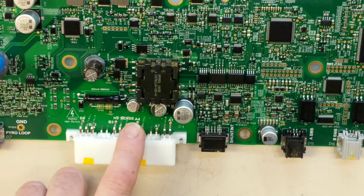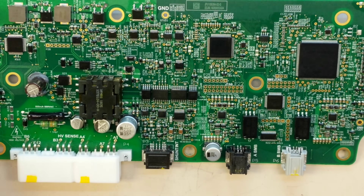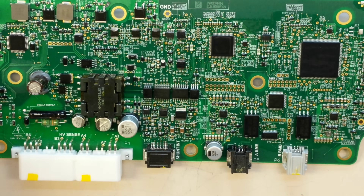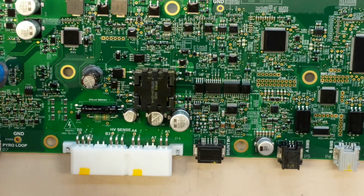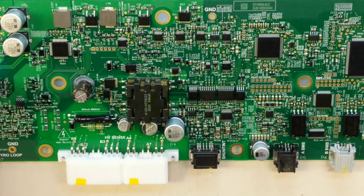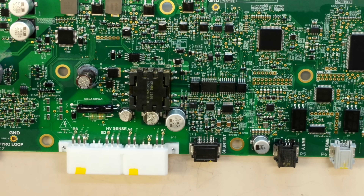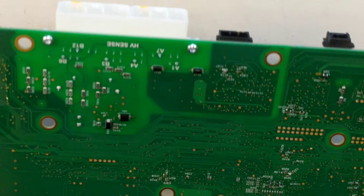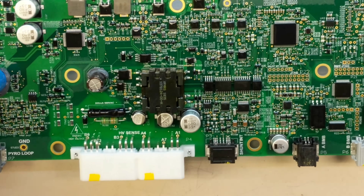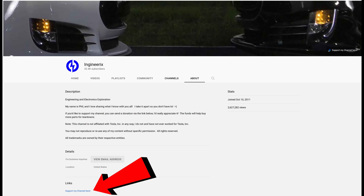This thing does have its own power supply, so even if you disconnect the car side of the pack, it can still blow the pyrofuse. Don't think that disconnecting the 12-volt battery means this system is completely dead — it can store enough charge to fire the pyrofuse. So take very good care if you're opening the pack, working on it, or welding around it. Welding could accidentally fire the pyrofuse. If you have any other questions, please leave them in the comments below — I'll try to answer most of them. If you'd like to support my channel financially, there's a link in the description. Subscribe and like if you enjoyed the video so I can keep making them. That's all I have for you today — everyone take care.